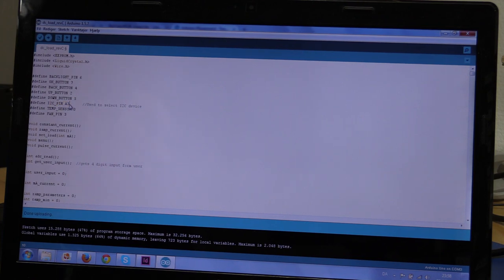that is, you might remember that transistor I had to add to the clock line to the DAC, I think it was. So this basically switches off the clock to the DAC when we send data to the ADC, because it just happened that the broadcast address for the DAC was the same as the address for the ADC. I can change the address on the DAC, but not the broadcast address. And the address on the ADC could not be changed. So I had to do that. Or I had to buy either another DAC or ADC. Well, that was confusing.